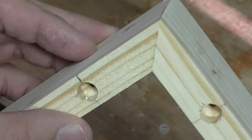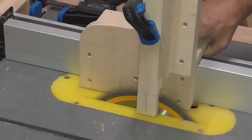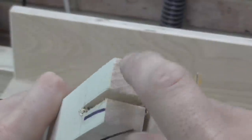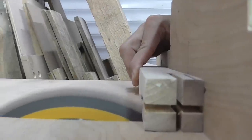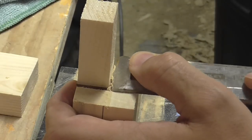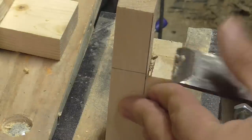For the purposes of the table the joint doesn't need to be exceptionally strong because the screws are going to go into the table top and we'll also have the leg in there. I cut the joint to join the table leg to the frame using my tenon jig. I've cut all the pieces lengthways and I'm going to use the cross cut sled just to remove the remaining pieces.